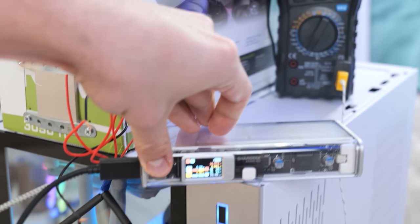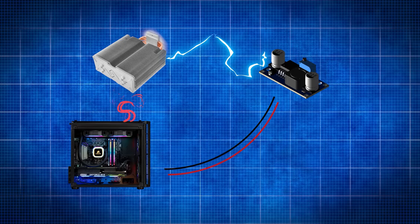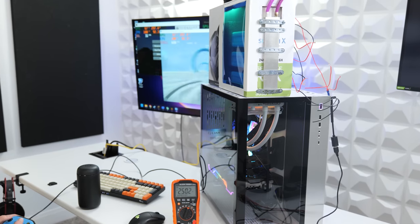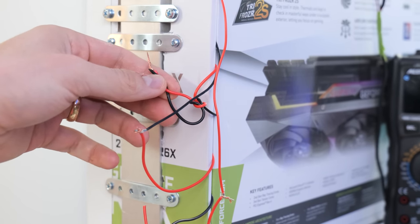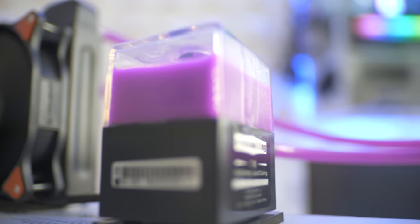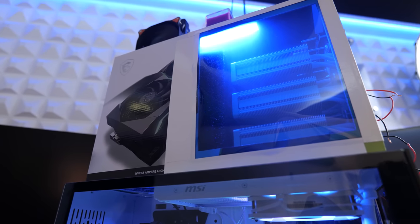You could save the energy by putting it into a battery, but I think the most effective use would be feeding it back into the power supply to increase overall PC efficiency. We peaked at about 2.7 volts, and it turns out one of my modules was broken — outputting 50 millivolts or less — so we'd be making about 25% more power if it wasn't broken. If I could do this with cheap stuff and a cardboard box, imagine with efficient modules properly manufactured — you could probably generate 70% more power, take heat off your air conditioner, and if you got 20 watts off the heat you could run it back into itself.